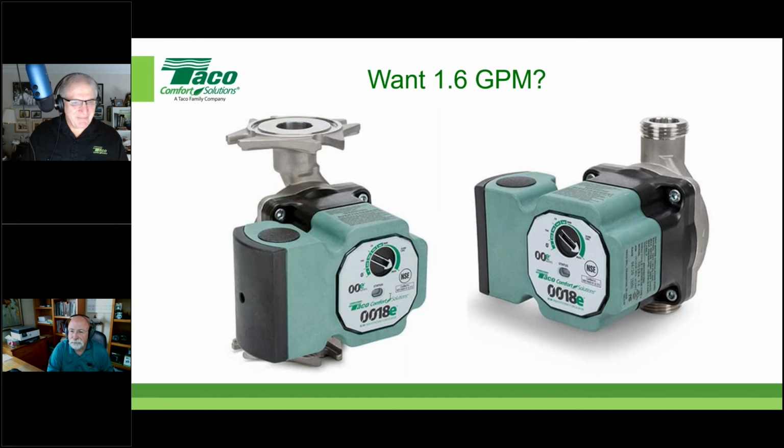Cool. Here we go. We're designing new homes, mostly tankless water heaters, sometimes multiple tankless on big homes. Yep, that's a growing thing. And as we said earlier, Bill, you're probably seeing that the tankless manufacturers, because of misapplications, are kind of taking control of their own DHW recirc by and large. It's not universal, but they're taking control of that internally.